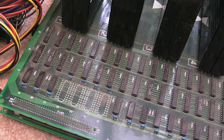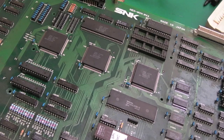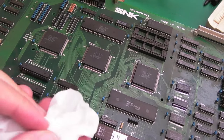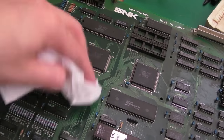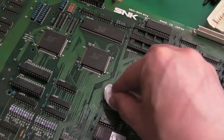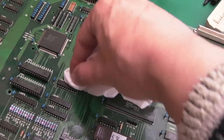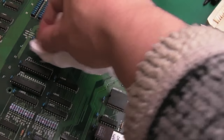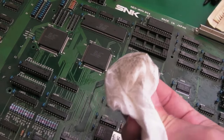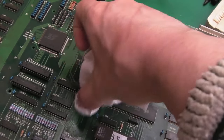Get some speakers or something attached, just give you a close look at the board and scan around it so you can see some of the components on here - they're pretty beefy boards, there's a lot to them. There are many ways to go about cleaning something like this, but it is a very large board. So I'm just going to go around initially with some paper towel with IPA and go over the main areas on the PCB. It's pretty dirty. I'll do this first and then go over with cotton buds and a brush and run some IPA over it to get under the chips and round the connections.